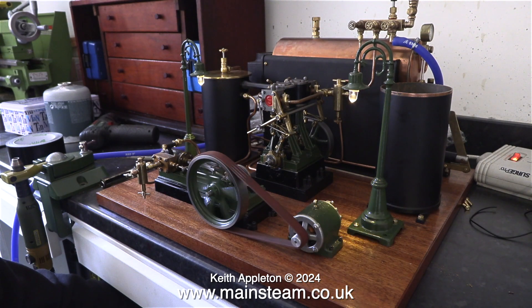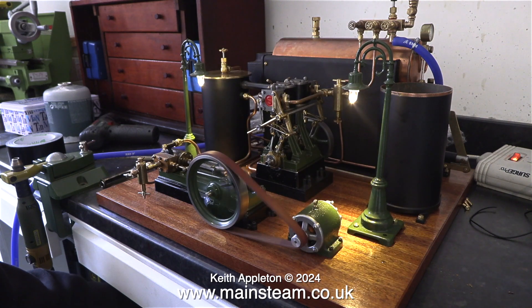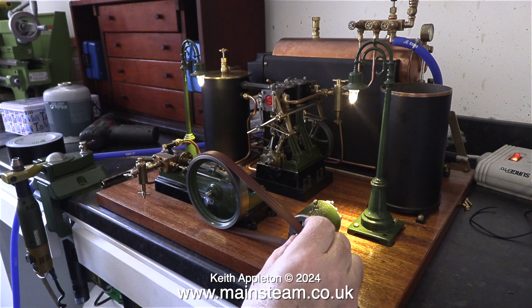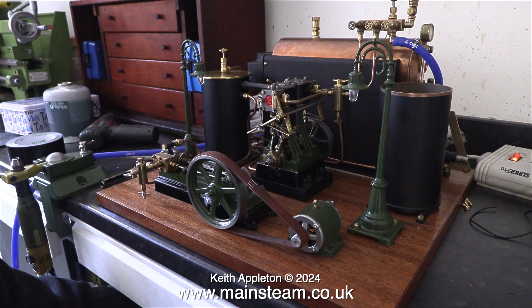In the next episode, I'm going to have a quick look at the S50 and advance the timing to stop the ticking, which is very noticeable at very low speeds and also makes the lamps flash. The ticking is less noticeable at the speed that the S50 needs to run at to successfully generate enough electricity for the lamps. I'm going to remove a bit of metal from each end of the slide valve, which should make it uncover the ports at the right time.